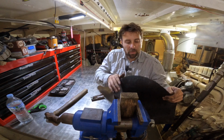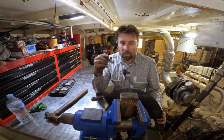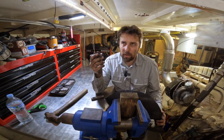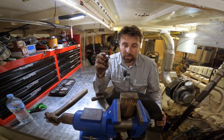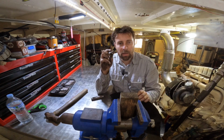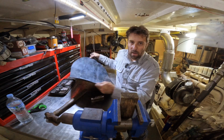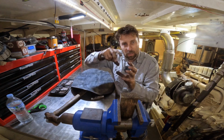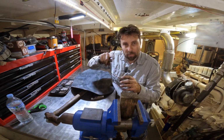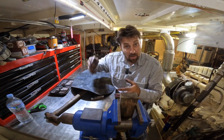I mentioned this before, but there's a trick that I like to use when I'm making these gaskets. So the bolts that we have are close enough to 16 mil. They're an imperial size. I think they're 5/8 from memory, but basically 16 mil is the right size to have a nice snug fit when you squeeze this gasket over top. Now, if you do a 16 mil hole all the way around in every single one of these holes, if you get your alignment not quite perfect, you end up stretching or trying to compress the rubber and you end up with wrinkles and it ends up being crap. It basically means you've got a chance that there's a leakage there.